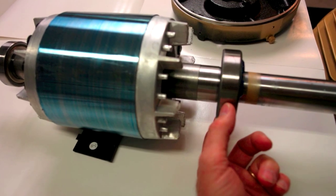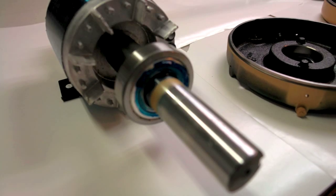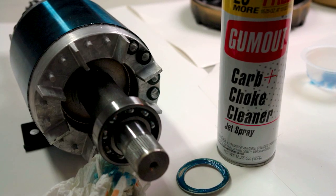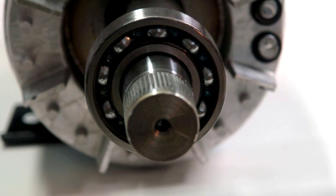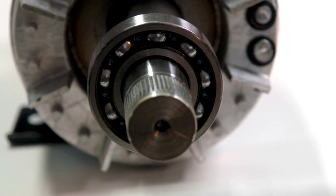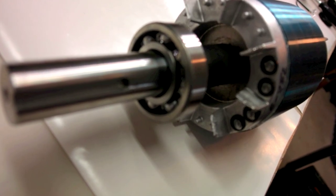We're going to pull the grease caps off and snap them off. Going from the inside of the shaft, use a small screwdriver to pop it off, then spray it with carburetor choke cleaner or soak it in automatic transmission fluid. Get all that grease out. You're going to re-lubricate it with a high-precision oil.